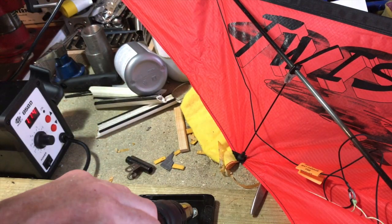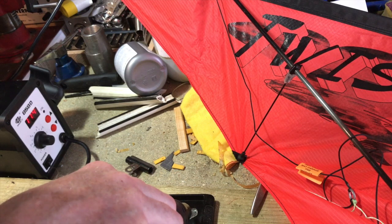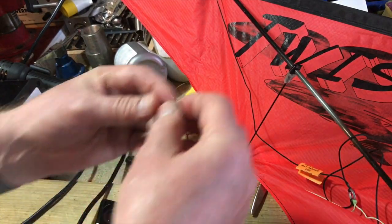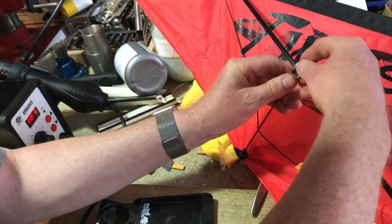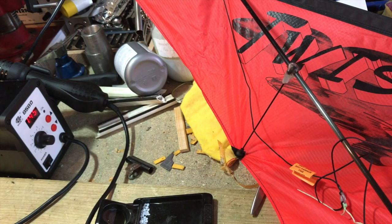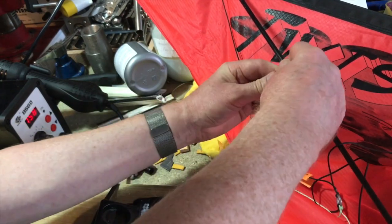Despite the fact that we're operating at a reasonably high temperature, this stuff is handleable, which is amazing for a plastic — quite often plastic gets so hot that it will basically sear onto your skin and cause terrible burns, whereas this stuff is pretty safe because of the low temperatures. I'm going to take this and put it over the top and squeeze it down. There we have it — it's not the prettiest of fixes, but once that cools it goes thick white and it's really, really hard and it won't be coming off anytime soon.